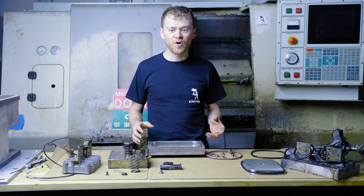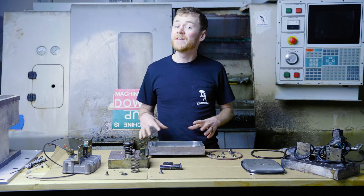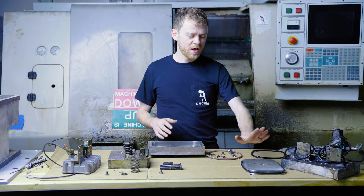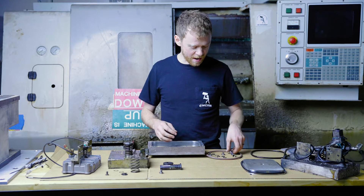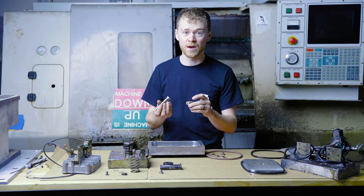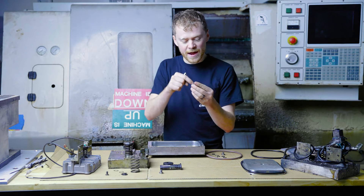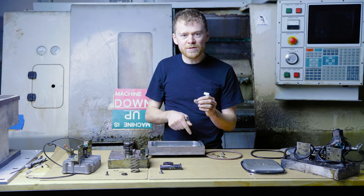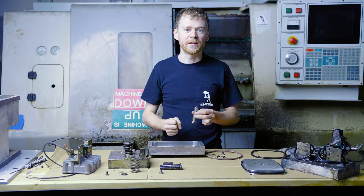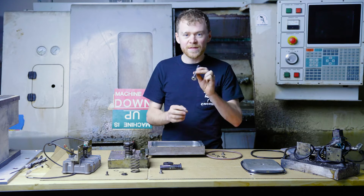A little bit of overview. There are three different sizes of TRPs — tool release pistons. This is the piston that when air is applied to it, it unclamps the drawbar by pushing the bottom of the piston down through the shaft and then contacting the top of the drawbar with the left-hand threaded bolt. There's a little hole inside that runs air all the way through the drawbar, giving it that little burst of air out of the tool when you hear it unclamp. If you hit the button and feel air on the bottom of the spindle, that's what you're feeling.